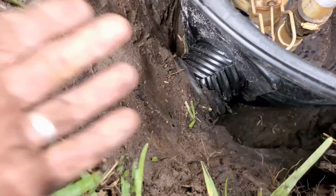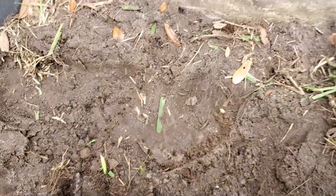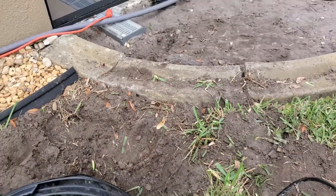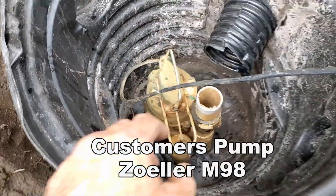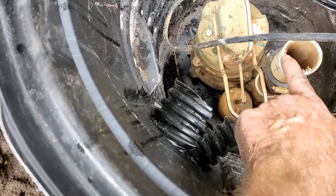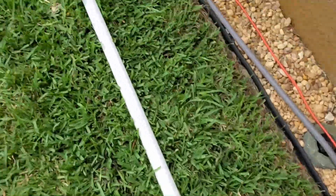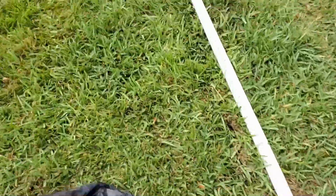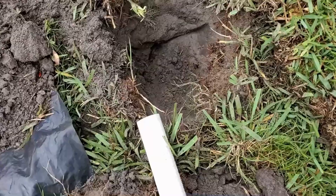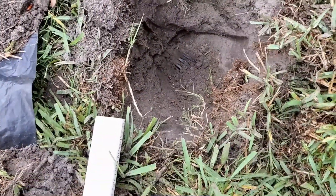We've connected the outlet line also, so just in case that line backs up, it'll come into the pit. You can see we're picking up the lanai and the downspout. We're almost set. Next, we're going to put the check valve on here, come over, and go through the side of the pit, hook up our inch-and-a-half pipe. It'll go around to the side, comes all the way around, and tie into the line right down here. We'll tie in down there, and it'll pump it on out to the front.